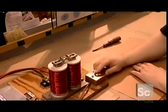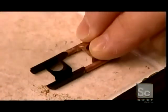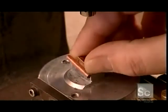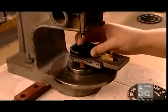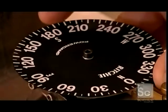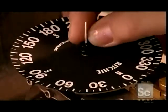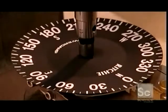To make a nautical compass, they use a device to magnetize a special metal alloy. A technician slips a retainer ring onto a jig and positions the magnet on top of it. She places an aluminum skirt over the magnet to support the compass dial, which goes on next. She inserts a pivot needle in the center to allow the dial to rotate, then press fits all the pieces together.